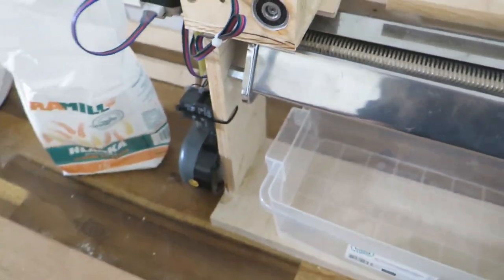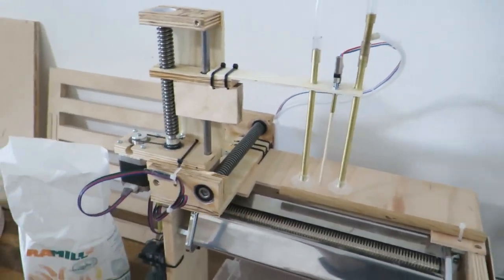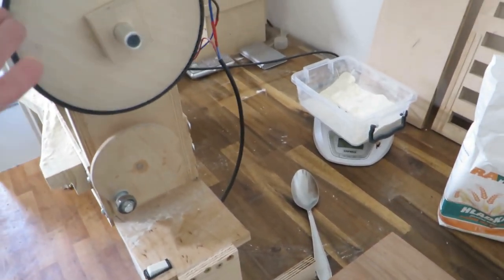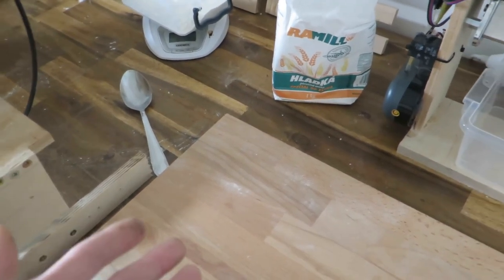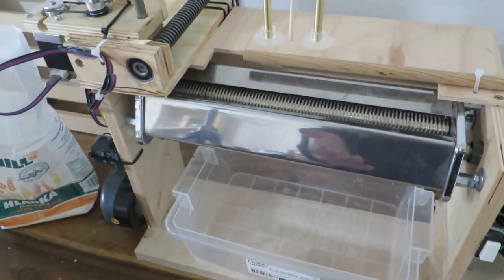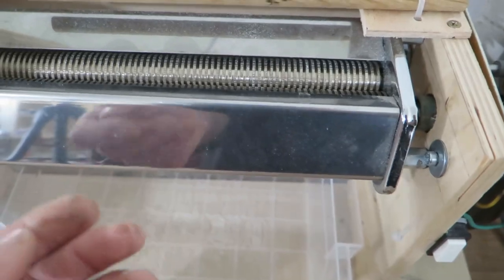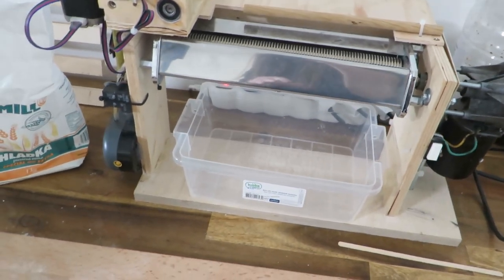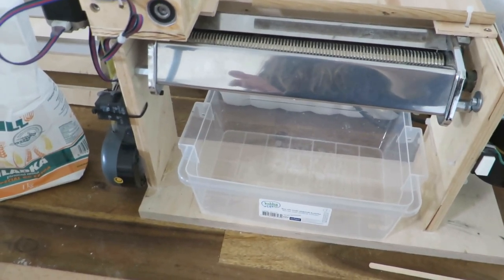So basically the point is that when I am drying the pasta, I could already start forming the other dough that I had stored for next processing. When you dry the pasta, you have to process it basically immediately, because otherwise it will dry up too much and this will powderize the thing, it will break. So it is a very tightly controlled process parameter, I guess, as to how the sheets of dough are dried.